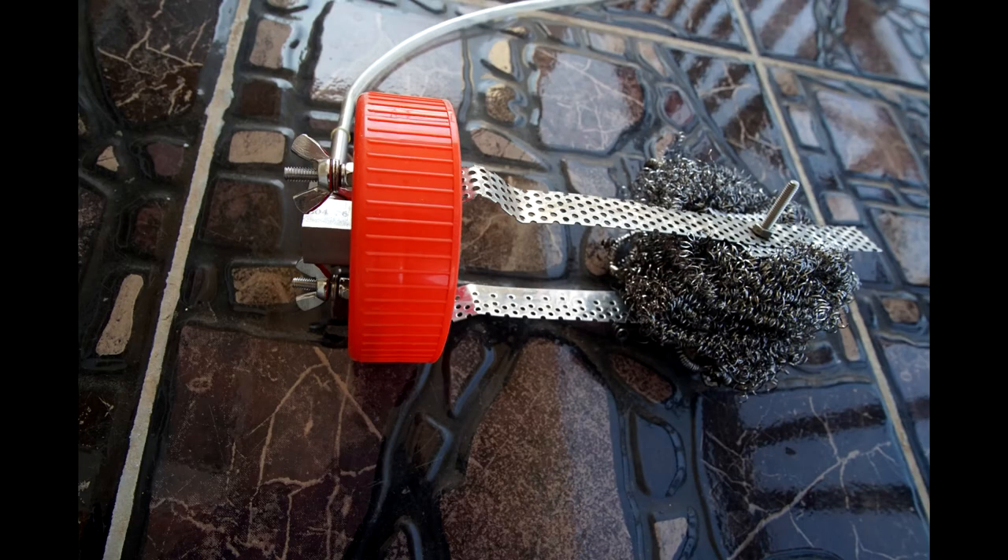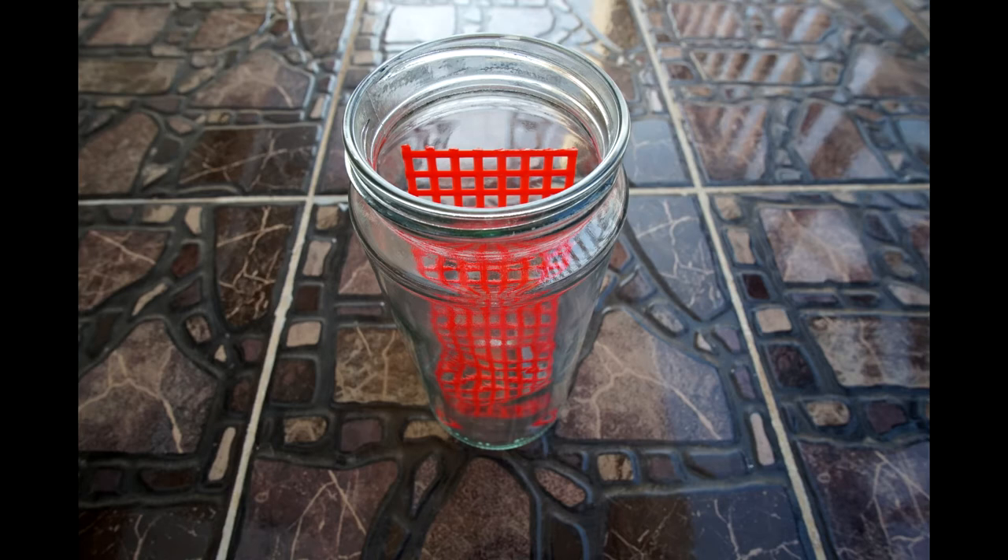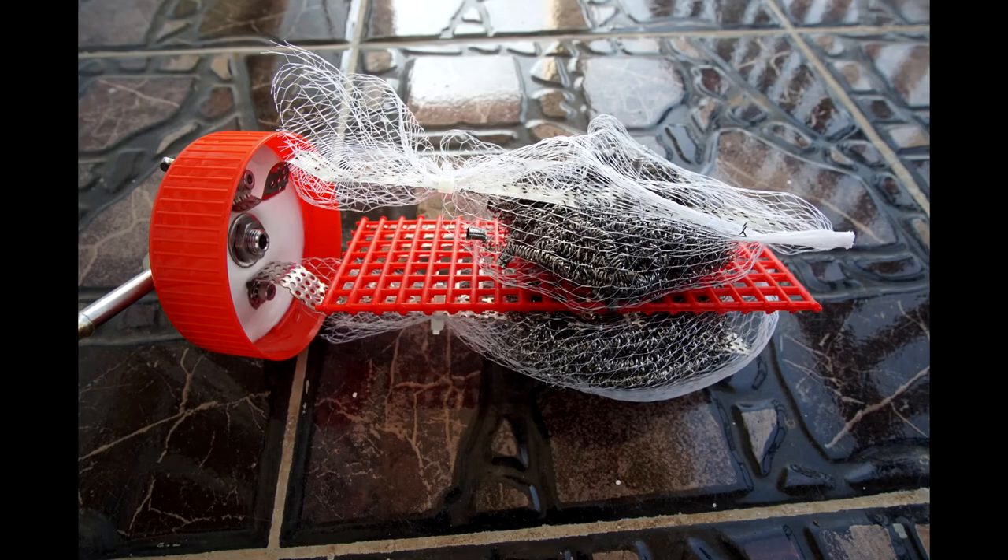Because there's a danger of the electrodes shorting together - and you don't want a spark inside a hydrogen-oxygen generator - they are each encased in a mesh bag like the ones you get oranges in, secured with a cable tie. Then a double-thickness separator plate, made from a plastic tray, is fitted in between so there's no chance they should short out. I also check with a meter before putting in the electrolyte, because once you add electrolyte, the cell acts like a sort of capacitor and gives quite a low reading, but not a short circuit.